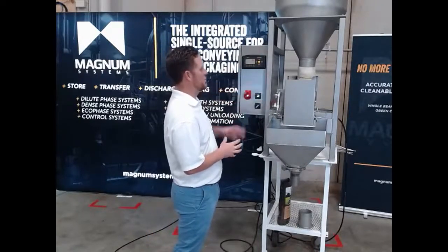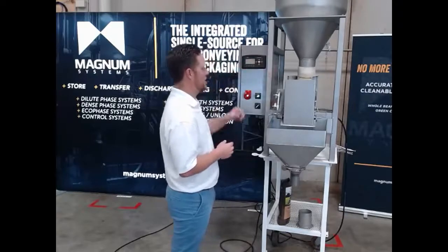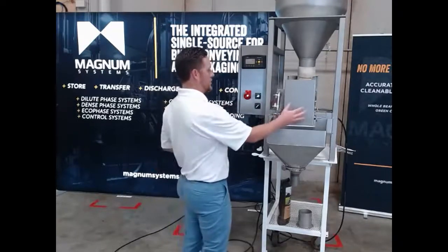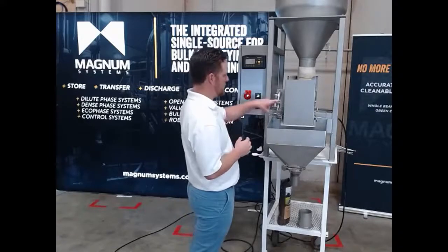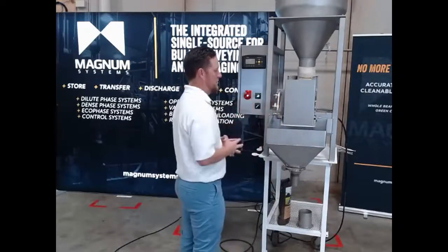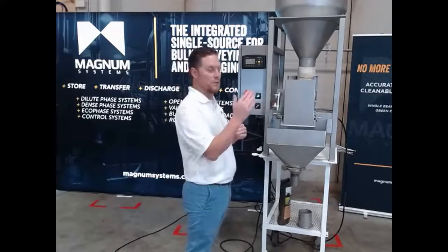The whole feeder itself has an open design — you can wipe down pretty much any area you need to. The transition piece between the hopper and the feeding tray easily slips up and down to adjust the bed depth of your vibratory filler depending on what type of product you're using. The net weight bucket here, mounted on the front, can be taken off very easily. There are three pins that hold it in place along with mounting lugs, and it just rests onto those lugs. This is also where the load cell comes into play, giving the signal back to the weight controller to help monitor the fill weights.